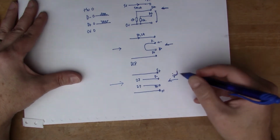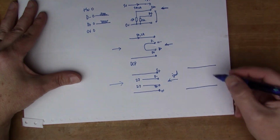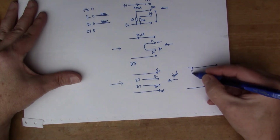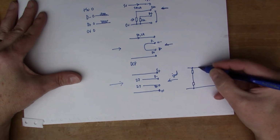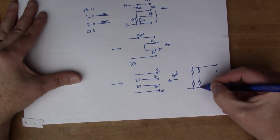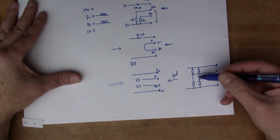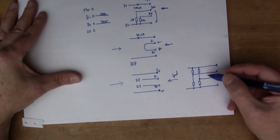So often inside the iPad chargers, what you see is actually a little resistive network, in fact. They put a couple of resistors between 5 volt and ground, like so. One goes to the D+ and one goes to the D-. So this resistive divider can present a voltage on these pins.